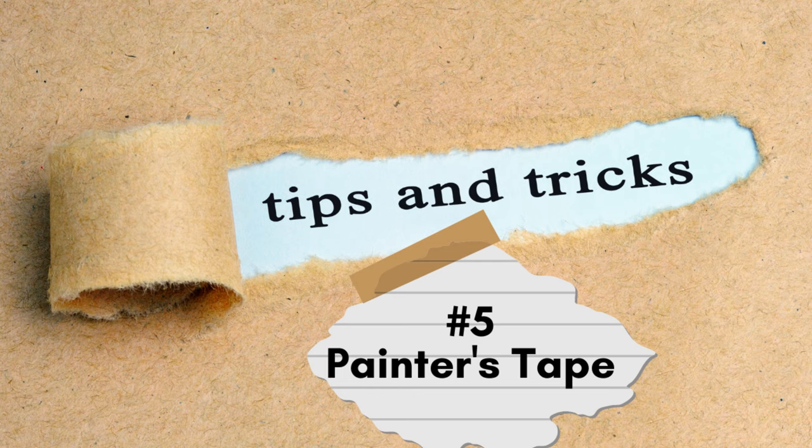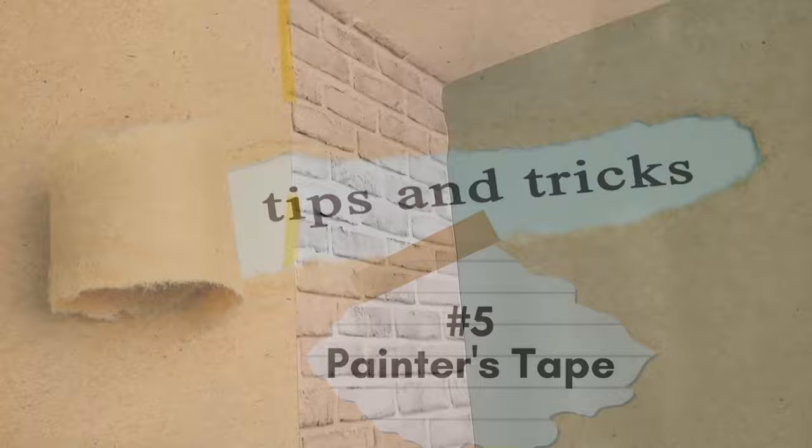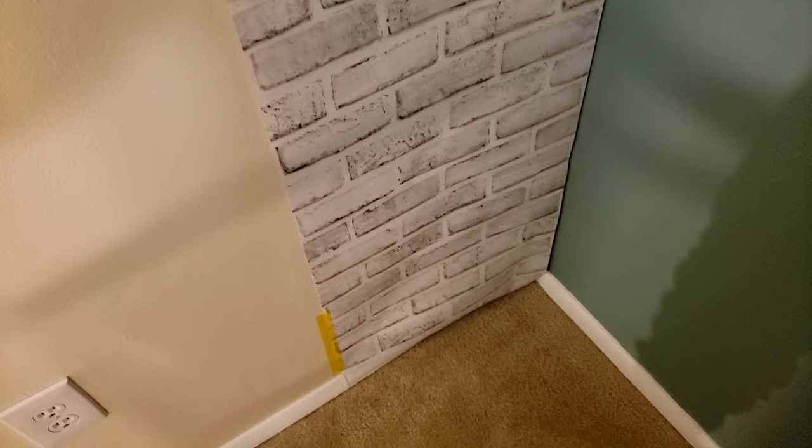Tip number five is hack time — this is the one thing that has helped me the most for proper alignment. I've seen people online recommend starting in the middle of your wall for a seamless look, but I find starting at the wall edge so I can line up perfectly is my best bet. Use painters tape to hold your pieces in place before you start, without removing the backing at all — let the tape act as a guide. I do one panel at a time.